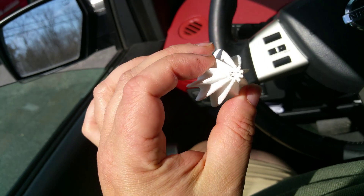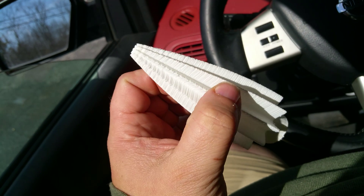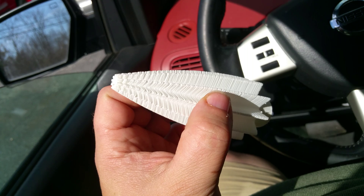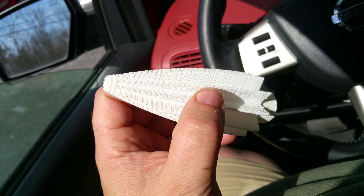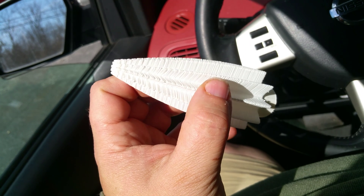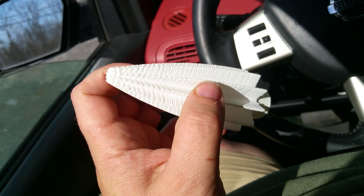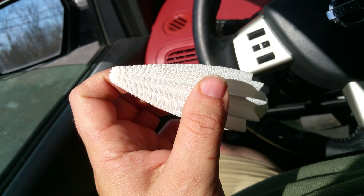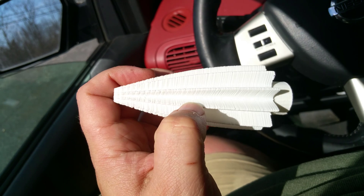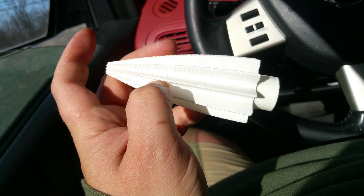With the nose cone I don't mind going double thickness, because you usually want the nose cone to be heavier anyway since it's going to hit the ground when the rocket recovers. I tried lowering the temperature - that does not help, it made it worse and made it brittle. This runs at 216 degrees Celsius stock, and apparently the MakerBot filament does not like going below that. When I got it down to 200 degrees the parts became super brittle and the layers weren't adhering properly.